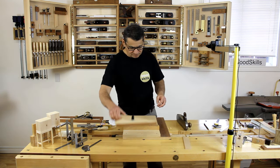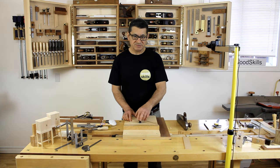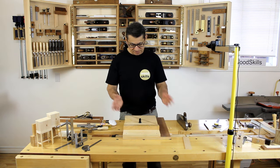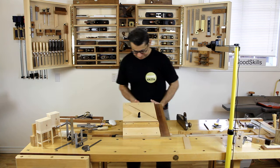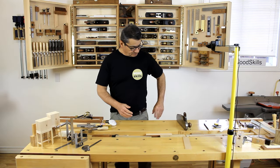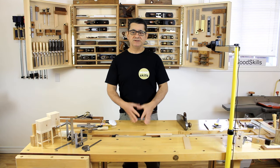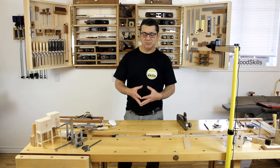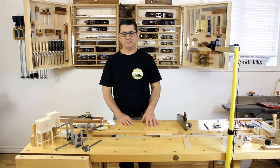It's a disadvantage of doing precision work on a table saw — if you're doing really precise work, it's much more advantageous to build yourself a shooting board. This one is left-hand oriented; you can simply swap everything around for right-hand use. Along with the shooting board, I use hand planes much more today than in the past. Hand planes introduce precision by default because they take thin shavings in thousandths of an inch — removing wood that thin is almost impossible to achieve with any power tool.